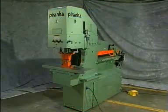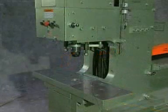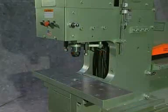Prior to any tooling changes, turn the punch end foot control off/on selector switch to the off position and turn the machine off. Now that the machine setup and control functions have been reviewed, we will demonstrate individual workstations. Before starting any operation, remove all tooling from the workstations not being used.